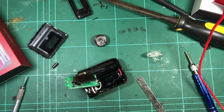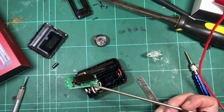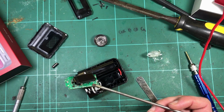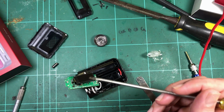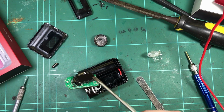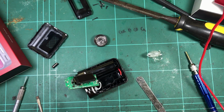Draw that like that. So the peaks are still at battery voltage, but what you do is you make how long it's switched on for skinnier. That just gives you a lower average voltage and lower average power. And it's really simple, it's really efficient, because the only losses are through the MOSFET. If you've got a really low RDS(on), which is the resistance through the MOSFET when it's switched on, then there's very little loss, because they're down in milliohms.